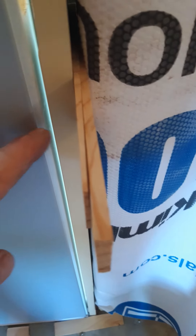Once you get that done, shim it to the proper height. Then on the hinge side, put a couple shims — what you're trying to do is get the same reveal you have on the top. Follow that reveal from the top all the way down to the bottom, then put some screws in there and that'll set it.